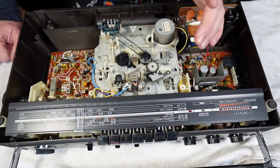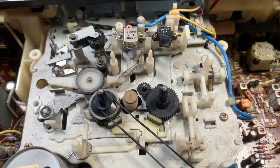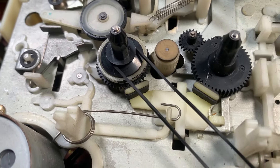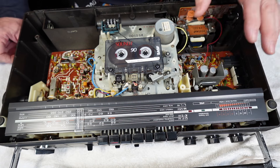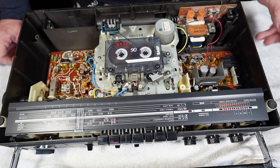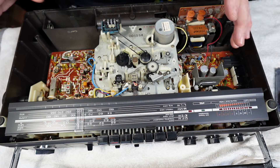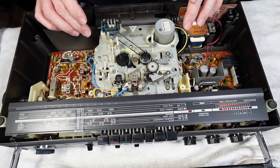With regard to the tape mech, we've got the motor just here with your adjustment screw nearby. I love this configuration because you can literally drop a cassette in and play it in situ, then use the motor adjustment screw to set the speed — quite cool. A lot of boom boxes you have to put it all back together or have the mech balanced precariously on cables while you adjust from the back. This is dead easy to work on.